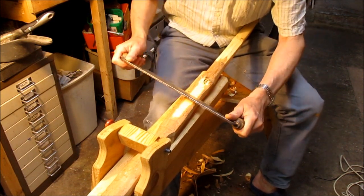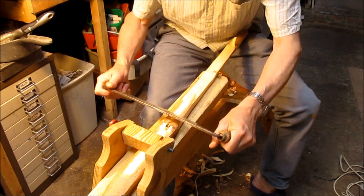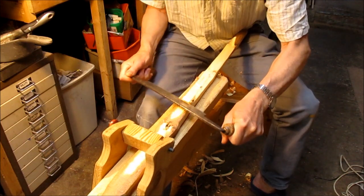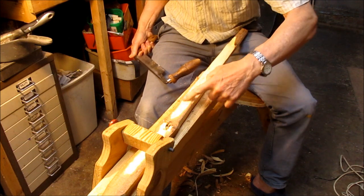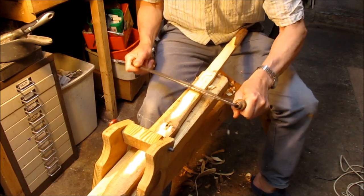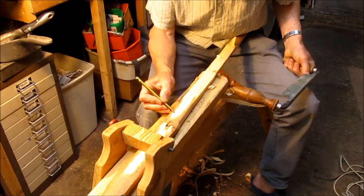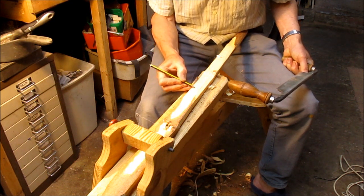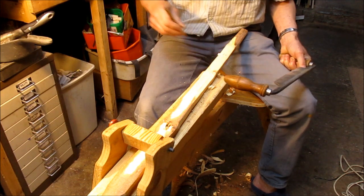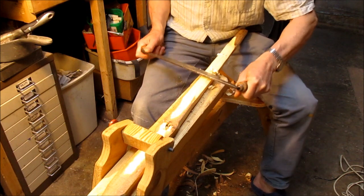As I'm always saying, it's sort of successive approximation, and I'm leaving extra sapwood at that knot. But I can see this area and that area, and I can blend the lines of growth rings in. So here I can see a ring sort of doing this at the moment, and then another one here. You sort of join it up. You don't have to be absolutely perfect, but the lines that get exposed are a guide.